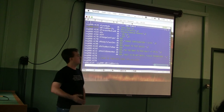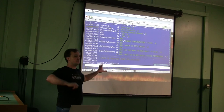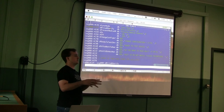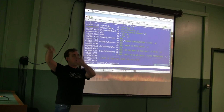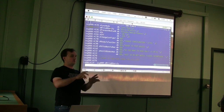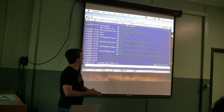That's the lowdown intro, but the short story is: I did end up fixing it. I found that I had accidentally bricked it because when the card loads its configuration from EPROM, if you accidentally set the number of disks and tapes present to zero, it crashed. It started by pre-decrementing the count and checking for zero, but when you pre-decrement zero you get 255 on an 8-bit counter, and it just spun off into space and died. Not only was I able to find the problem and fix it by rewriting the EPROM, I was also able to find some spare space nearby with redundant instructions, and write a check for that problem so I couldn't break it again. That's a very concrete example of where disassembling vintage code can help a lot.